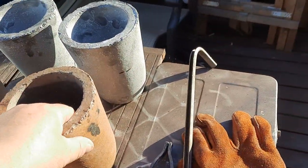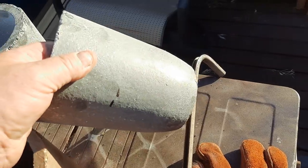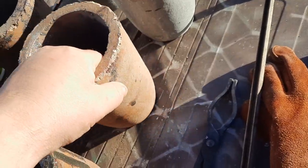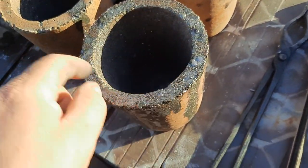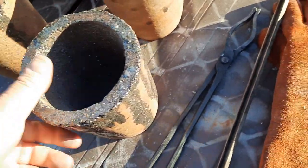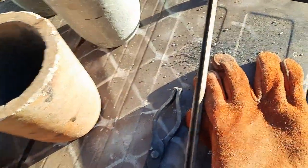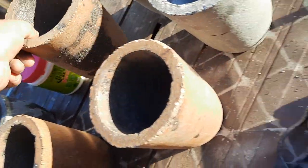We've got four done - that was the last one we just did. That's slightly warm but I can still hold it. You can see the difference - that's not tempered at all, and that is tempered. That's only tempered up to 700 degrees because borax melts at 700 degrees. This one here I put a lot of borax in and tipped it on top. They're very distinctive now so I know which one's which. I call that one the scar, that one we'll make the copper one, that one's a patchy one.